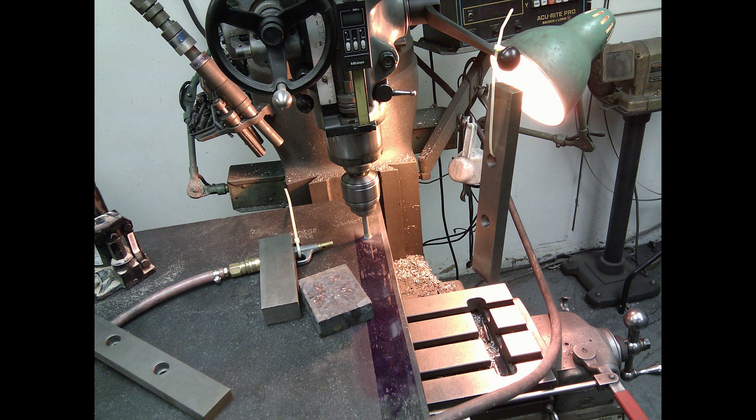The bit was almost solid — it only had a small wedge missing for dust evacuation and there was no hole through the center. I thought I could get this working by blowing compressed air at the drill and weighing down the feed arm to use it as an auto-feed, but progress was very slow because the dust never got evacuated from the hole after I had drilled to a certain depth. On top of all this, it was a bad idea anyway because abrasive dust was blowing all over the Bridgeport mill.